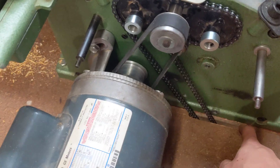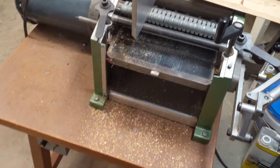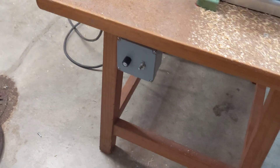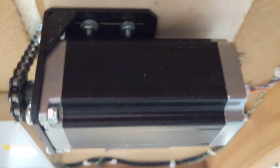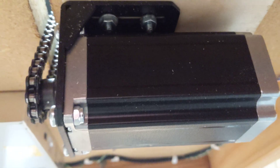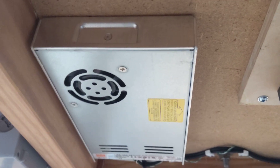What I did was I routed this hole, extended the chain, and added a drive down below. I have on/off and speed control there. Looking up underneath, there's a NEMA 23 stepper — it's about the largest one you can buy, around $30 not including the controller. Then there's a 10-tooth sprocket, about a $30 controller, and a $40 48-volt DC power supply.